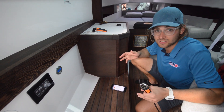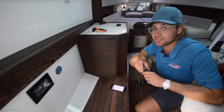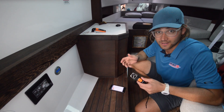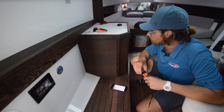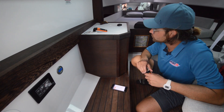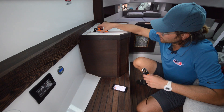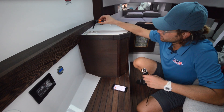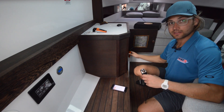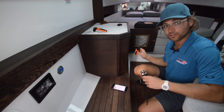What I want to do today is show you our latest install here on an Axopar 37 sun top, just to show you that it's true. I have my Testo smart probes here — two temperature probes — one in the supply duct and the other in front of our air handler that's in this cabinet for a return air temperature.